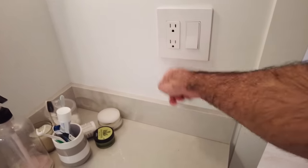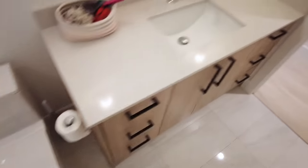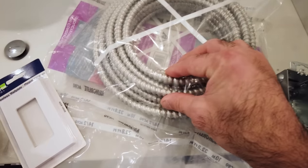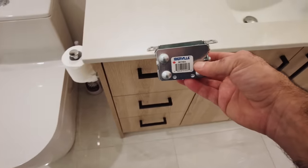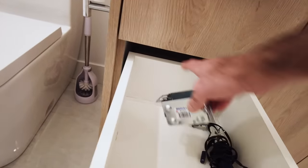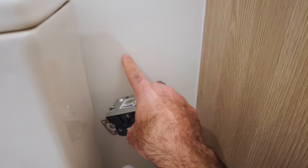So if I wire a new outlet in that washroom it will be protected. You need to have ground fault protection, especially in washrooms that can get wet. Here's the plan: I'll try to wire the power lines inside the wall, into the cabinet, run it through the cabinet, and install a new outlet on the side. Let's go get some parts. If you're running wires outside the walls you need to get these protected wires covered in steel to make sure you don't accidentally puncture them. This is the metal box for the outlet that will go inside the cabinet.